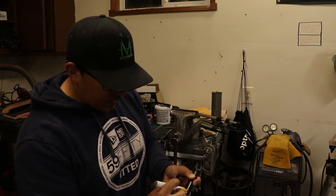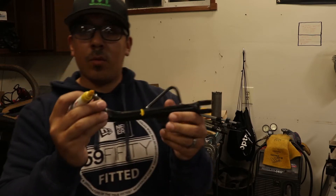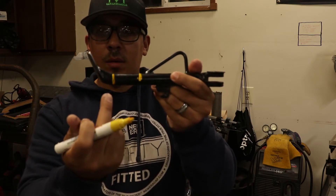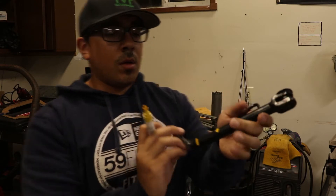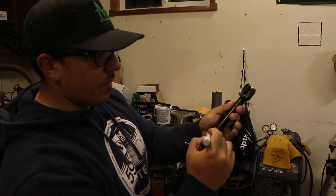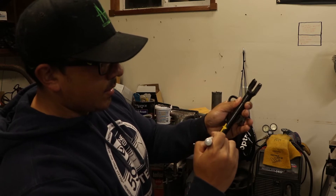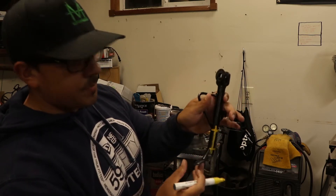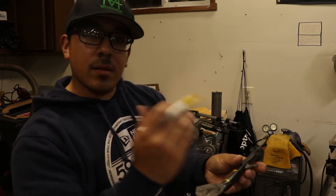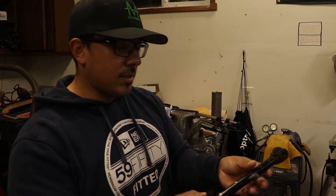What I'm going to do is mark where I think the straightest point is, because we don't want to cut into the curve. Look at the backside before it actually starts curving down — it's going to be probably right here, right before it starts curving. The way I'm going to do it — and it could be completely different than what other people have done — is use a paint marker, so it won't come off most surfaces. I'm going to draw a line that goes through both of those marks three different times, so once I cut in between, I can take the bottom half and the top half, put them together, tack it, and have my line all the way around to make sure it's straight.